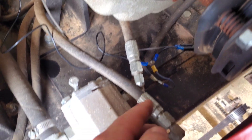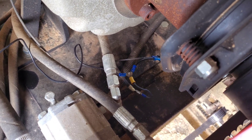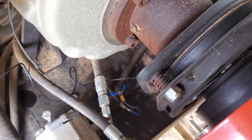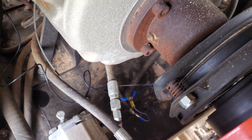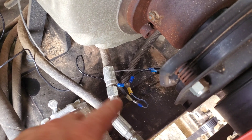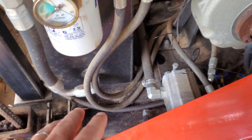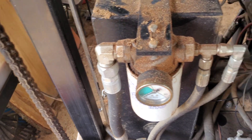I'll need to come back here and put electrical tape on, but right now nothing is touching. I want to show how you can test this even with the sawmill off — I just need the key in the run position on the diesel model. The gas model might be slightly different. We can test it by flipping the clutch: we'll hear a click noise, and then we'll see if water's flowing. Once everything tests properly, I'll tape this up so we don't get a shorting situation. If these wires were to touch, you would short out — no bueno. So let's go down below to see where we'll hook up the solenoid on the frame. You need to make sure you're lower than your tank, otherwise you won't get proper flow.